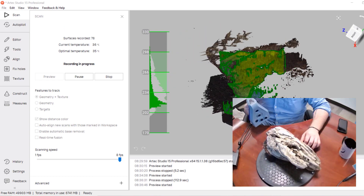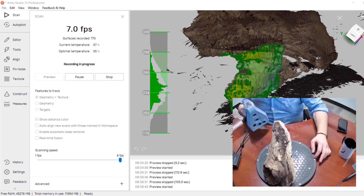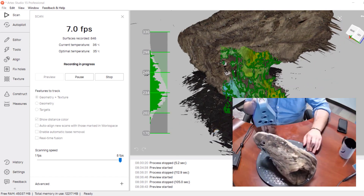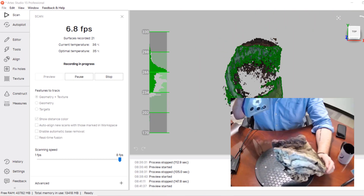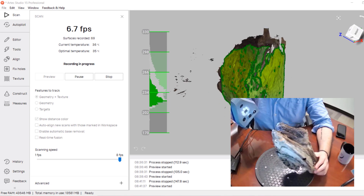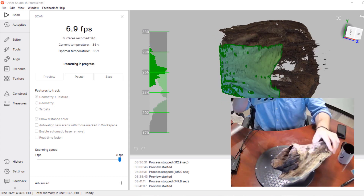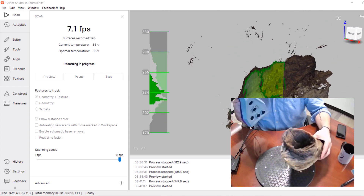I'm not too concerned about getting all the smaller holes within a single scan, since I'm going to be capturing this in three different positions — when I align the scans together you'll see that I've captured these smaller holes at all the necessary angles. My third scan will be the piece on its side, allowing me to have a nice bridge between the top and bottom half. Finally, since this larger hole at the top is such a unique feature, I want to do a fourth scan focusing just on it. I can hold the part up and rotate it while also rotating the scanner, allowing me to capture really deep into that hole. This is possible because the scanner is tracking based off of geometry and color, something a target-based or laser scanner would never be able to do.